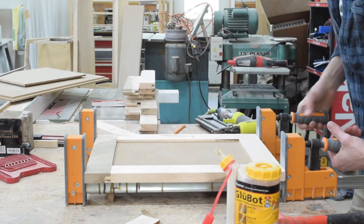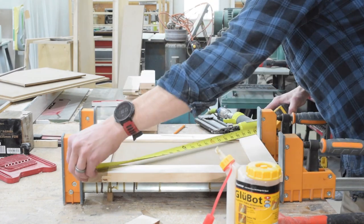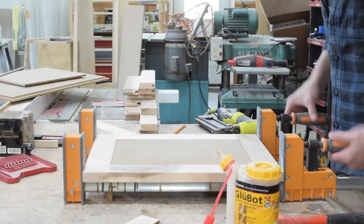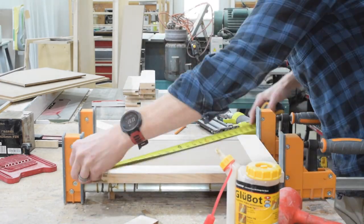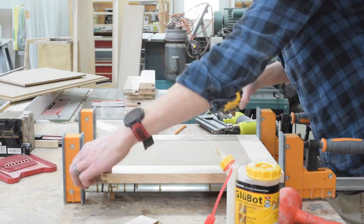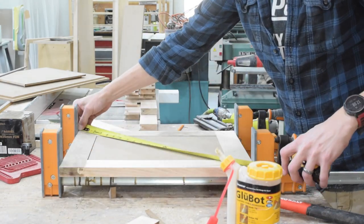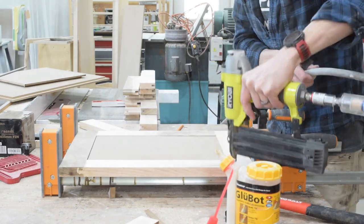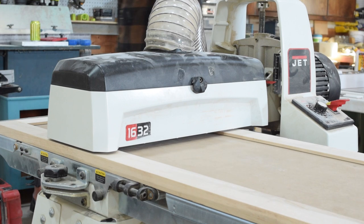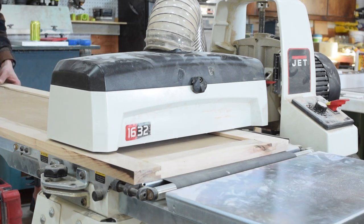I've got a very simple method for putting my doors together. I set them in a pair of parallel clamps, check the diagonals to make sure they're the same size, and once everything is squared up and clamped in place, I hit it with 5/8ths brad nails to hold it together. What that does is allow me to have almost a production level of output — in the clamps, nail it, and it's out of the clamps. So far I haven't had any doors fail. I see a lot of other larger cabinet shops doing that procedure, so I feel confident in it.